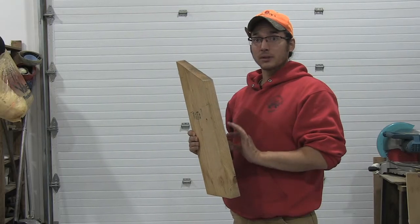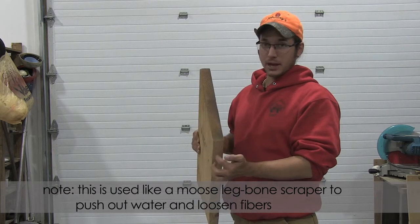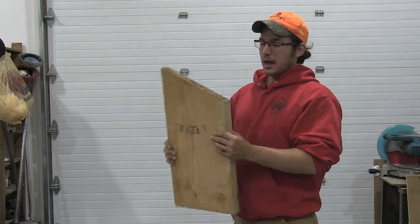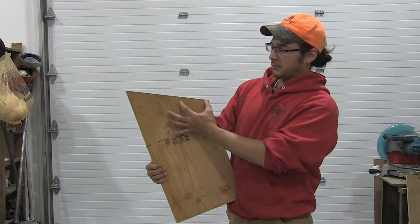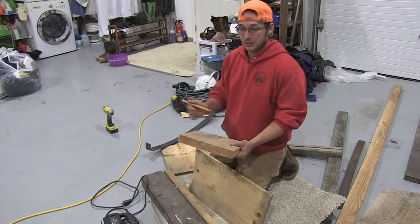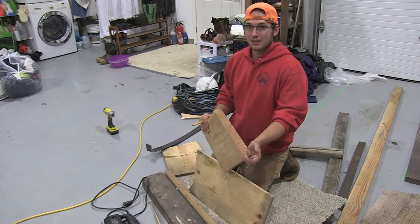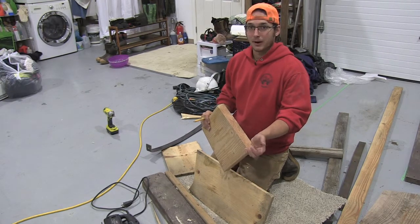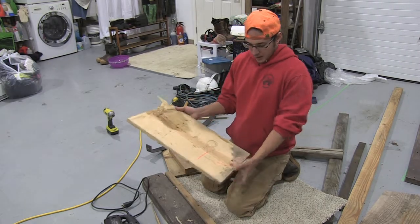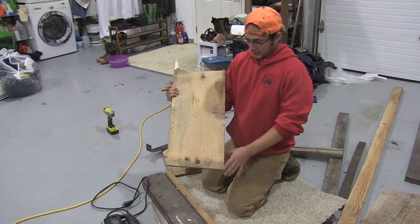For a handle tool, we want one solid piece of wood thick enough for a beveled edge while retaining structural strength, with the grain running end-grain. The tool will be wide at the top, narrowing to a comfortable handle. Originally I planned to use a 2x12, but it's a bit thick for everyone's hands, so I'm switching to 1x material. I'm checking both sides for clear wood, avoiding a knot here — this section has nice straight grain.